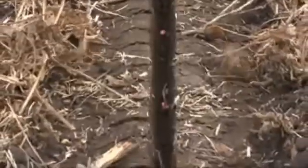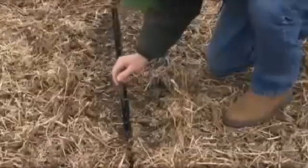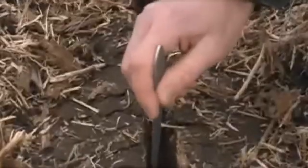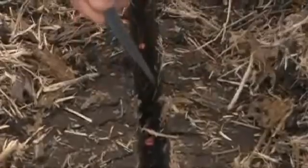If there is too much downforce margin, the side walls of the seed furrow may be compacted. In this example, too much downforce margin has been set for the field conditions. Notice how the sides of the seed trench are compacted, and the gauge wheels may also leave deep tracks or ridges in the soil from too much pressure.